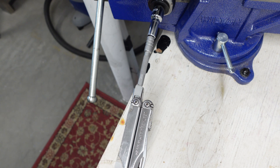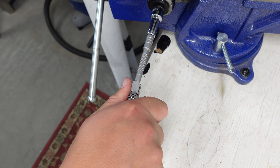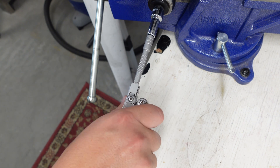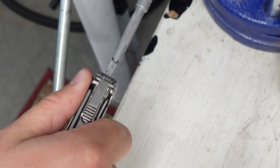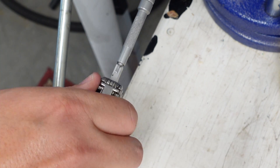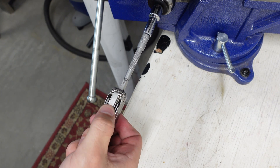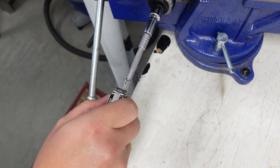The objective is to see how hard I can twist the multi-tool — how much torque I can personally impart into it. That sets the baseline for the maximum load we can ever expect on the bit adapter. Then we'll clamp the Leatherman Wave into the vice and use the torque wrench until it fails. With the wrench set to 70 inch-pounds, it's pretty difficult — you can see the whole tool physically deflecting. That's about all I can comfortably do with a screwdriver grip.